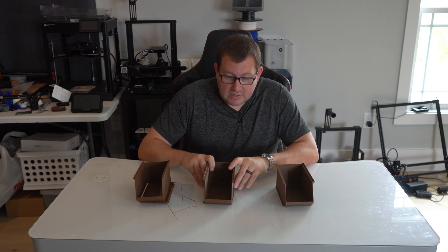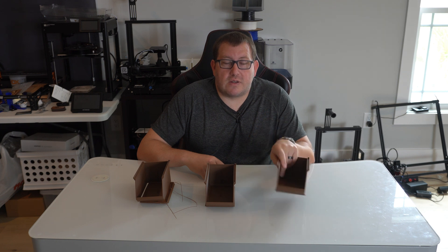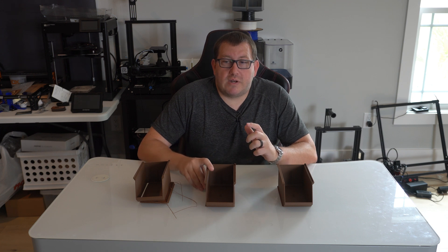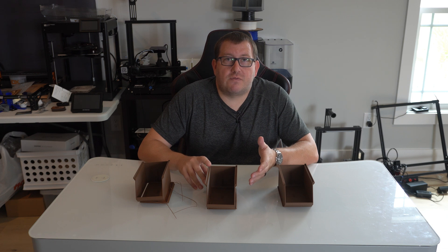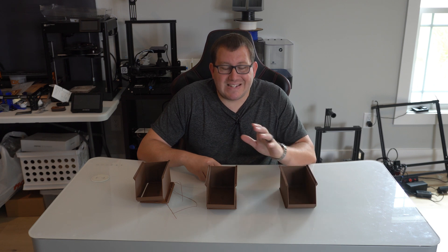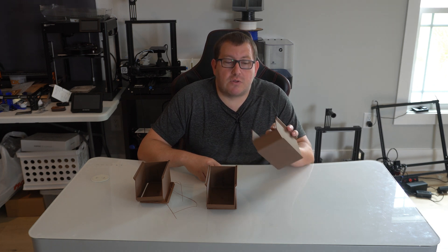So let's talk about the fix. All I ended up doing was increasing the print temperature by 10 degrees Celsius, and I was able to get a nice smooth line — that allowed the filament to flow through faster. When you're printing at around 250–300 millimeters per second with larger parts, the filament just needs to be a little bit hotter to flow properly. I stepped it up by five degrees first and it seemed okay, but the very next print had the same issue. I bumped it up another five — so 10 degrees total — and was able to print five or six of these with no issues.